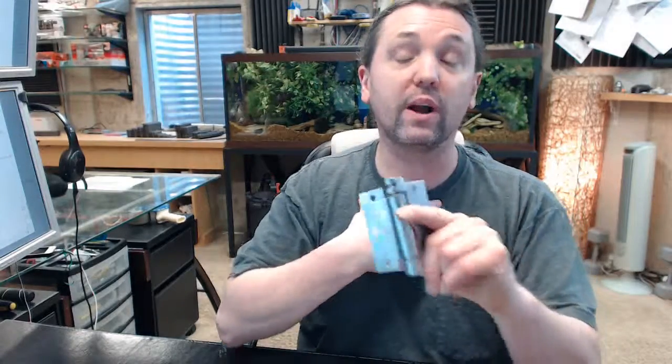But when you get into solid core doors and exterior applications, certainly, you're going to want to consider having more spring power. Now, I'm not a fan at all of spring hinges doing the job of actually closing a door. I don't believe it's the proper hardware for the job. But the reality is that there are times, many times, when a spring hinge is the only piece of hardware that can be used to get the door to close.